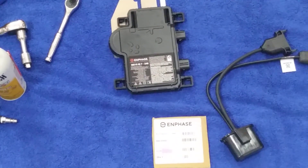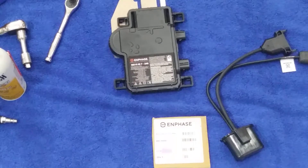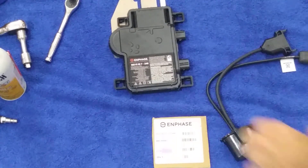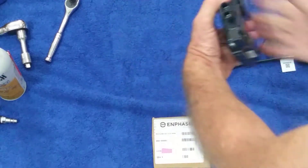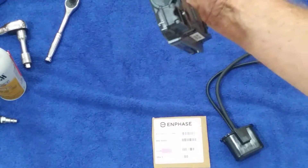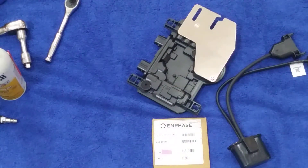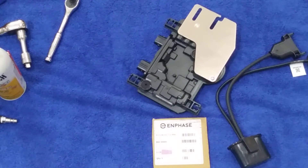When I did my first unit, as soon as I connected the solar panel, there's an LED light on the side of the inverter that actually came on — green. I said holy moly, this thing is alive already! But it wasn't, because I had the power shut off. I finished the connections, went down, turned it on, phoned up Enphase, gave them the serial number of the new inverter, they programmed it in, and voila — everything was up and running.